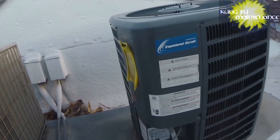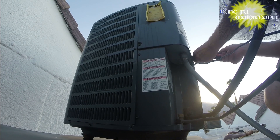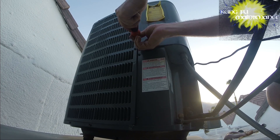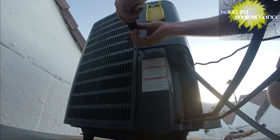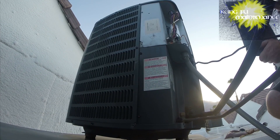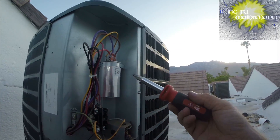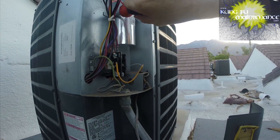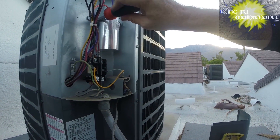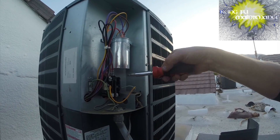That's the sound of a unit that's trying to start. I've noticed my units need a hard start kit — they benefit from it. So I'm going to pull this and see if it has a hard start kit. I can do the live test — 2650 test. No hard start kit. My units definitely benefit. It looks like a bigger capacitor — I think that's a 45/5. I hate how they turn these where you can't read them. It actually turned out to be a 40/5.